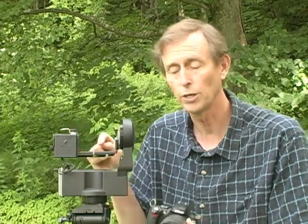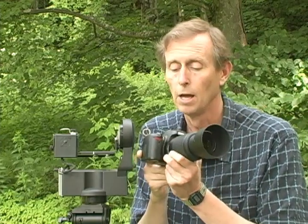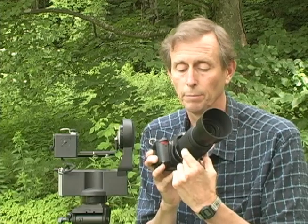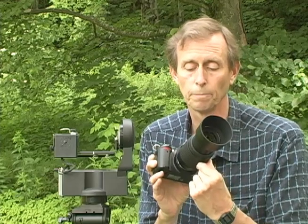So in order for the nodal point of a lens with a diameter greater than 70 millimeters to be mounted at that double point of rotation, at least two adjustments have to be made to the imager. And with this camera, the Nikon D40, those modifications will allow lenses up to 76 millimeters. Not that much of a difference, but enough to allow this lens, the Nikkor 55 to 200 millimeter VR zoom, and some other Nikkor lenses to be mounted at the nodal point.